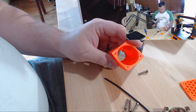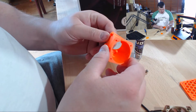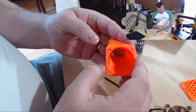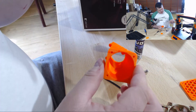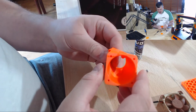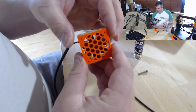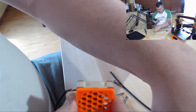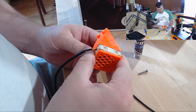I have printed out two things for mounting the fan. The first one is a duct to install on the printer where the original fan is, and that is with a slight angle because the fan is bigger and in the original place there is no space for the bigger fan — so you have to move it away from the print head. Then I printed out a fan guard to have in front of the fan, just because I don't want my fingers to get any fan. So that will go on top and this will go mounted where the original fan is.